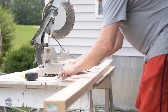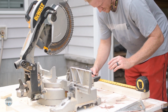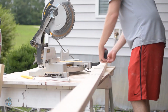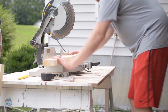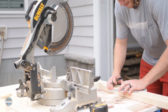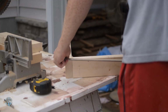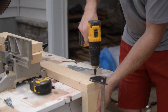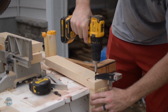The dust collector needs a frame to mount on, so I cut a couple of 2x4s to the lengths I needed. Once everything was cut to length, I clamped the boards together, countersunk, glued, and screwed. Countersinking isn't necessary since it's just shop furniture, but I got some new countersink bits and wanted to have some fun.